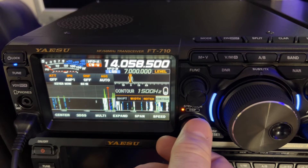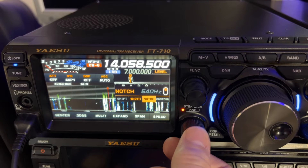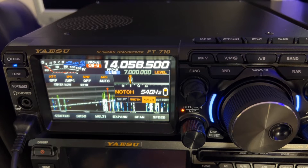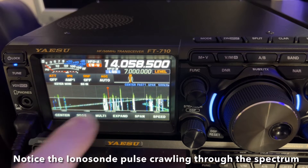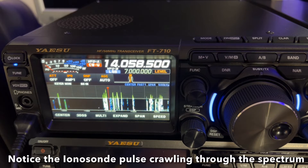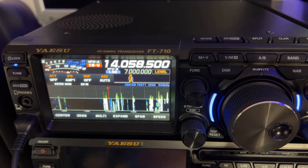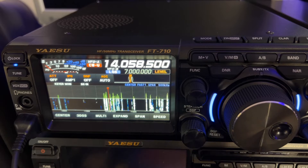I'm going to try my notch trick — 80 hertz below the sidetone. I may be able to get away with a 540. The FTDX10 was tight enough that I could get really close to my sidetone and not knock it out — like a 570 would even work. I can see ionosonde pulses going across checking propagation. Here's some 12-meter action — may be able to get him. These are all in North Georgia, so they're ground wave most likely, and here's one on 12 meters.